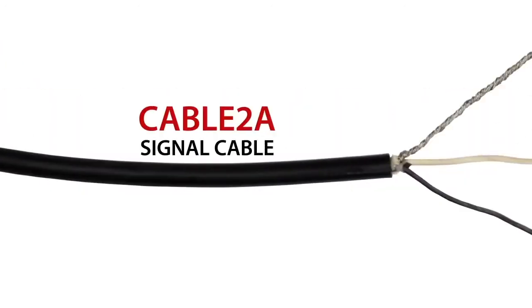The signal cable wires are connected to A, B, and G. The black wire is A, the white wire is B, and the two braided shields become G. Note that the G terminal in the MagMeter is not ground, but in this instance is an input to the measuring circuit.